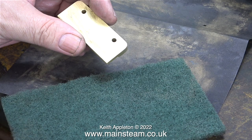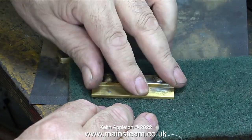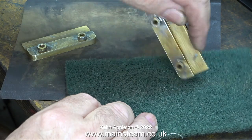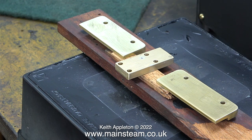As far as I'm aware the etching primer has phosphoric acid in it, which is great for steel parts — the acid etches the surface of the steel which makes the paint stick to the metal much better. The parts I'm working on now are the boiler mounting brackets and they are not made from steel; these are brass, so the acid isn't going to be very effective. I'm also going to paint the mounting for the pump. When it's all put together this base should look like it's part of the pump — that's the general idea. I use some pieces of wood to pack up the parts as shown here.